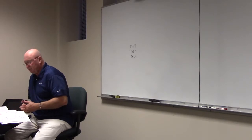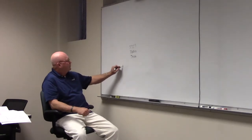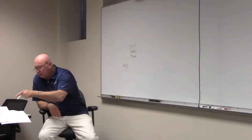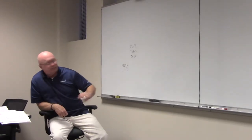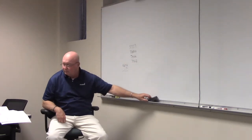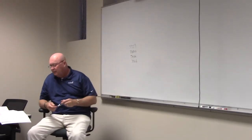Y'all see that in your book? We got how many? Four. 4,696. We're gonna multiply that then times what? 75%, because we can derate when there are four or more. We see it in the book. 3,522. Good. Everybody good on that?